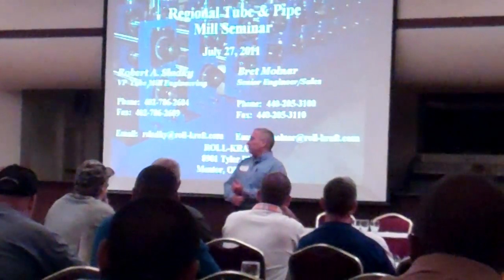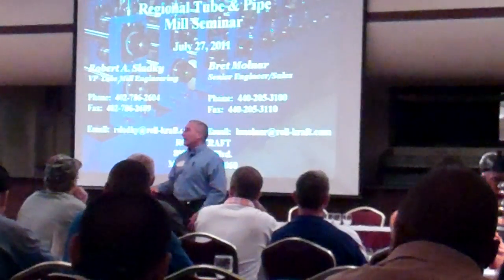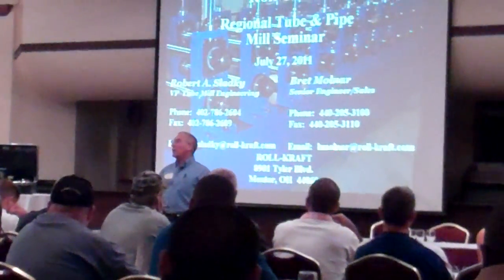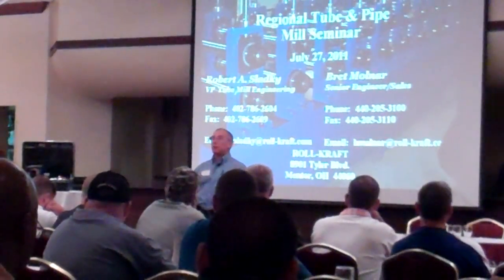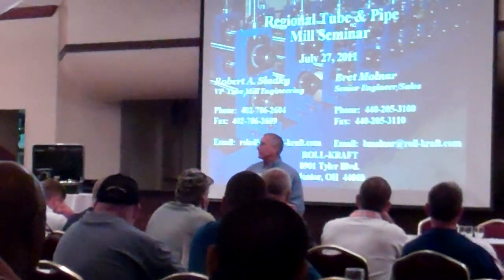When a designer has a set of tooling that he's making, there's always a pattern and a use for every stand on that mill. And you've got to make sure that you're setting them up the way they're designed, to get the optimum wear out of the tooling and the best result on the mill.